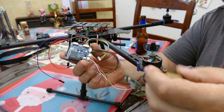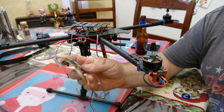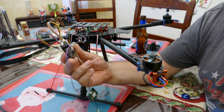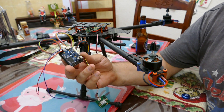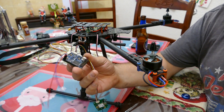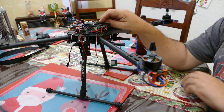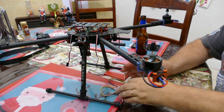There's the GPS board and a GPS antenna. This board is a MultiWii — MultiWii Pro or something, I can't remember exactly. It basically controls all the power to the motors. It also has a barometer and gyros among other things. It was going to go on here but I've since ordered a different, more advanced controller that's available now on the market, so I decided to put that on instead.